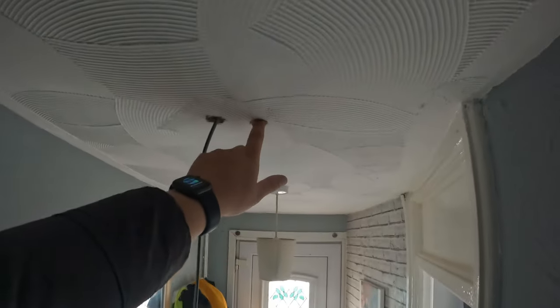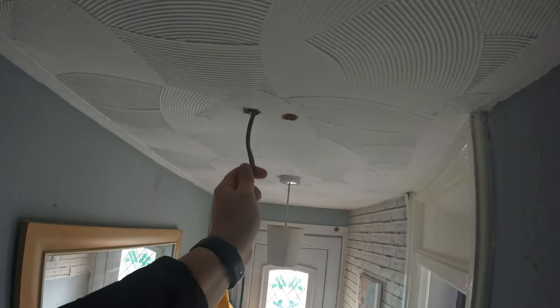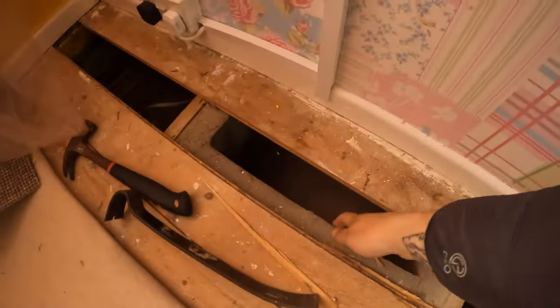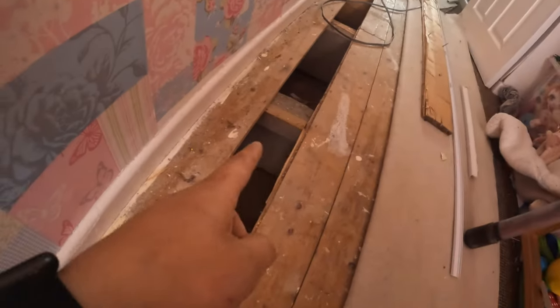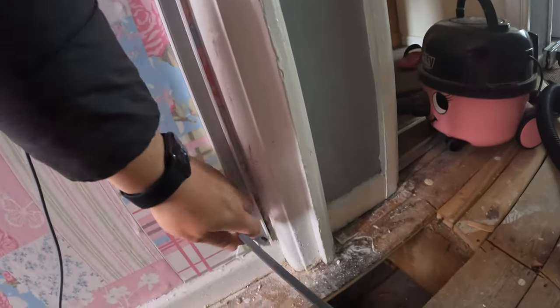So what Layton has done: he's drilled a hole down there and walked the cable down the stairs. He drilled one hole there and one there, but for some reason this ceiling has concrete pillars running through it — he hit the concrete, so he moved it over. The smoke alarm will cover that hole anyway. He's taken the three-core and earth up and managed to fish it across, pulling the floorboards up. These ceiling areas have concrete pads — almost like reinforcing the joists — I've never seen it before, but he managed to fish it across.